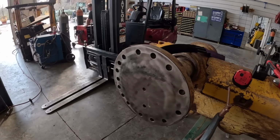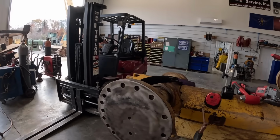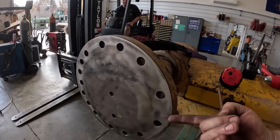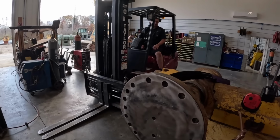All right, we've done some deciphering. We don't know if it's gonna work. This is a 14-inch diameter. My old Monarch lathe has a 14.5-inch swing. We think we might be able to chuck that end up there in the chuck. We've got a good center hole here. Try to center it. We may try to come in here and face this dude. We don't have to come all the way in because we've got a hole there. We'll get it on there and see what it acts like.